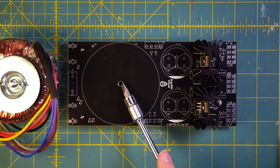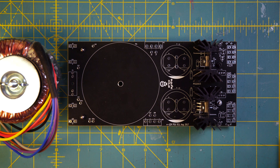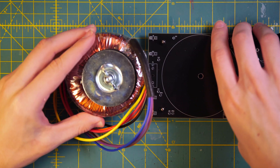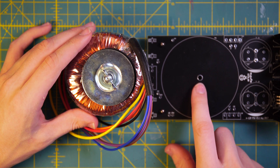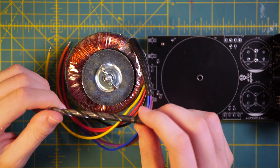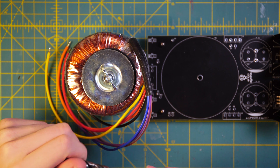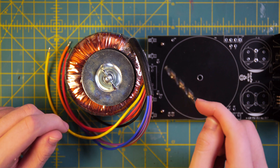The second issue is this power supply mounting hole. This transformer did not come with the power supply board and didn't come from Erika Synths either — I ordered it from Mouser, making sure I got the right specifications. However, this power supply mounts with an M6 screw, and this mounting hole is not for M6. So I'll need to drill it out using a quarter-inch drill bit. I'm doing this before attaching any fragile components, and I'll remove the voltage regulators first.